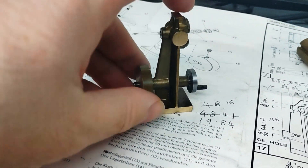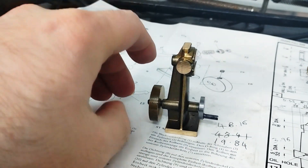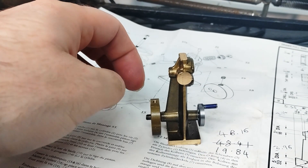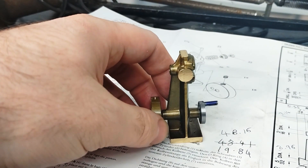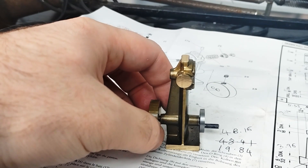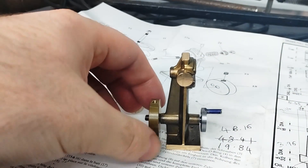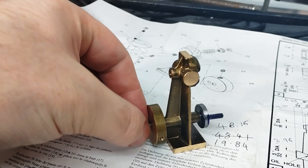There's a little bit more play in that shaft than what I was hoping for. As I was cutting it down to size, it went beyond the dimension I needed and it still wouldn't fit into the main body. It was only when I thought maybe I should ream it — I re-reamed the hole again and then the shaft slid through, but at that point it was already a little bit too loose. It's not too bad. I've trimmed down the shaft to length and this side to length. I guess once it's together there might be a little bit more to trim off.